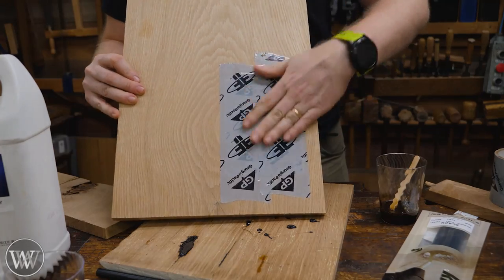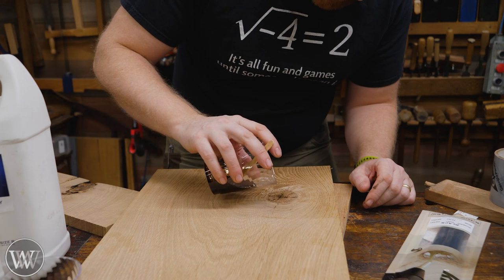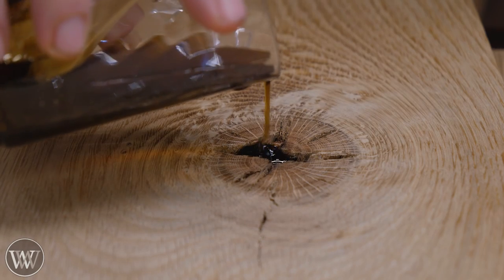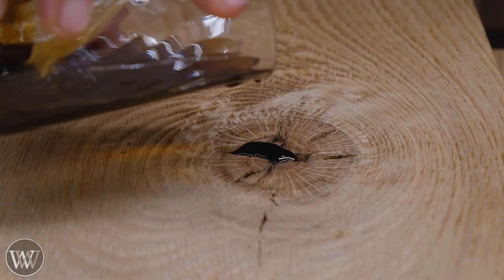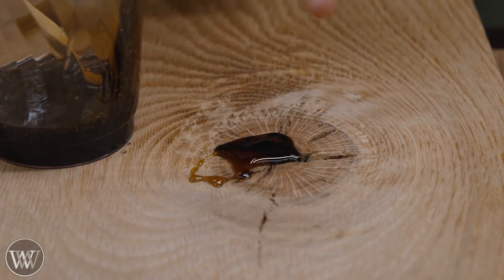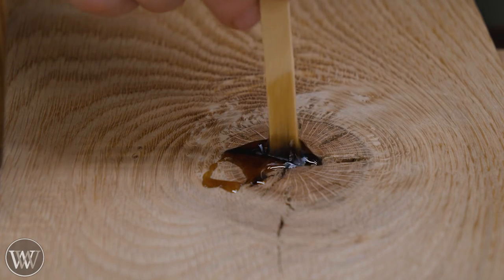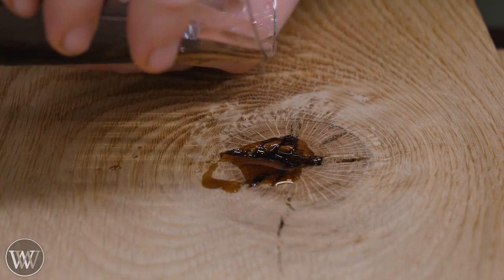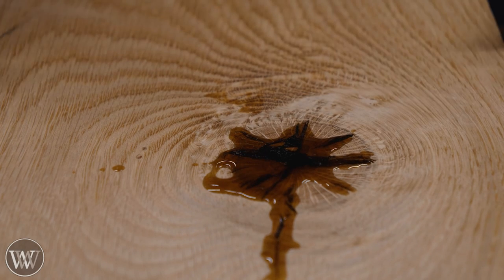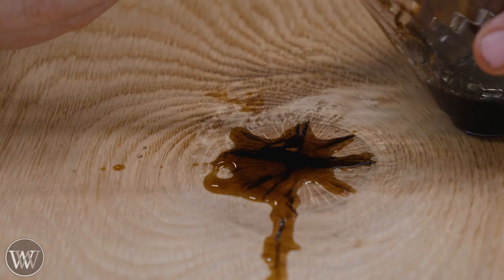To fill the void, I put some tape on the back — I generally use Tyvek tape, though in the past I've also used wrestling mat tape. The big trick to getting air bubbles out is don't pour the whole thing. Just pour it right down in the middle and keep pouring in that one spot and let the epoxy go where it needs to. You want to leave space for air bubbles to come out around it. Sometimes I'll take a stick and just agitate it in the middle to help it work around. Then as it starts to go down you can add more, and over the course of the next half hour to 45 minutes I'll let it sit and sometimes pop the bubbles.